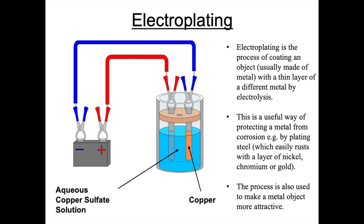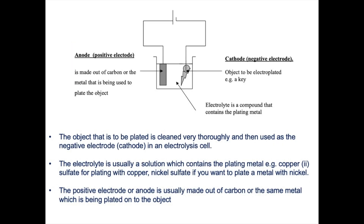To carry out an electroplating experiment you need a power supply, electrodes that dip into a solution of an ionic compound, and connecting wires. The solution must contain the metal you want to plate your object with — so if you want to plate an object with copper, the solution must be a copper compound such as copper nitrate or copper sulphate. If you want to electroplate a key or a coin, that object would be the negative electrode, because metals form at the negative electrode.